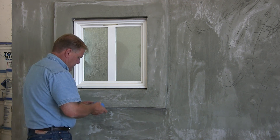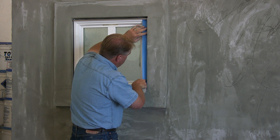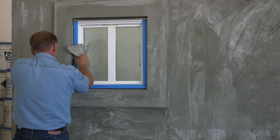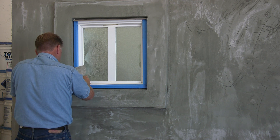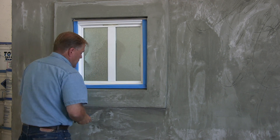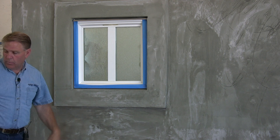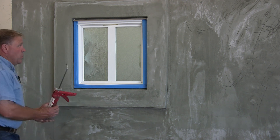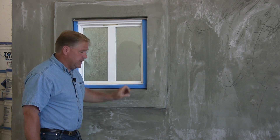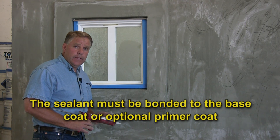At this point we'll take the mask off, leaving the backer rod exposed, and bring the tape right to the edge of the window — we've just sealed off that window so we don't get caulking material on the window frame. On the head flashing we did not put any backer rod in, nor will we seal that; we'll take care of that at a later point. An approved sealant is required. There are several types of approved sealants — make sure it's approved by the Total Wall manufacturer. You can call the office or factory and we can give you exactly what the approved sealants are.